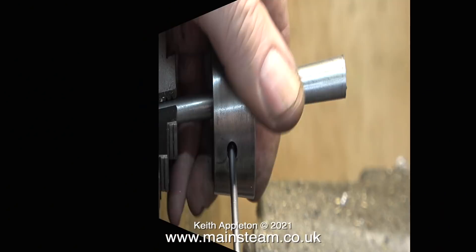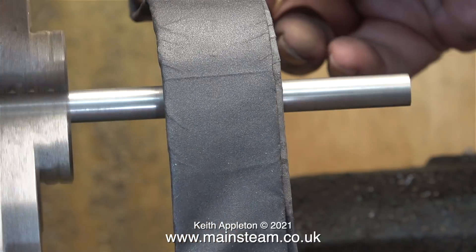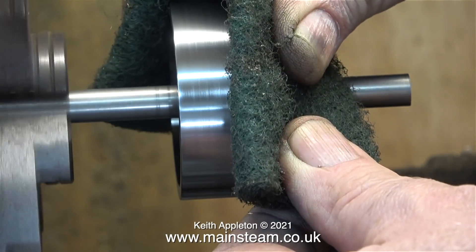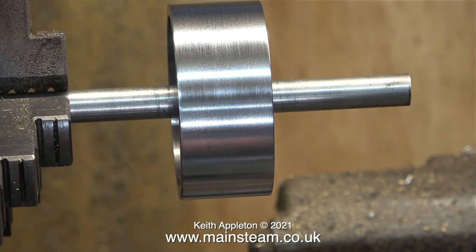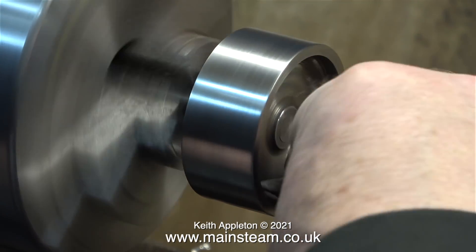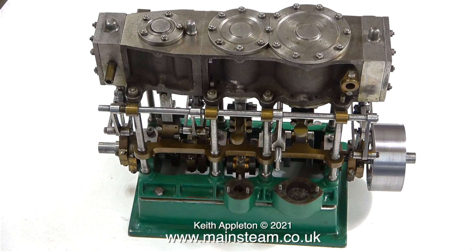Now that I have the flywheel loose in my hand, it's a perfect time to clean it up. The best way to clean up the flywheel is to mount it on a shaft in the lathe and spin it — it's a long way from the chuck, which is a health and safety consideration. Now the flywheel is spinning, it's far easier to clean using wet-and-dry sandpaper — this is 400 grit. It's a credit to Edward from the USA for keeping this engine in such good condition over such a long period. After the wet-and-dry sandpaper I finish off with some Scotch-Brite. Just look how true this flywheel is running — a real credit to the engineer who built this. I fold the sandpaper rather than putting my fingers all the way in. After a final cleanup with Scotch-Brite, it's time to fit the flywheel back to the engine. The flywheel is now right up against the eccentrics — there's less chance of bending the crankshaft that way.